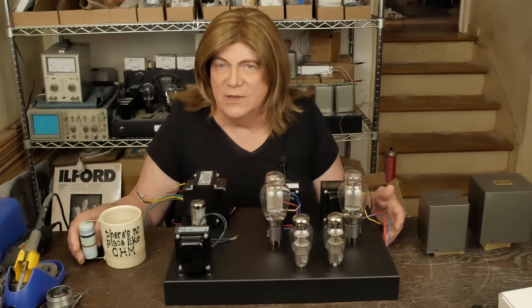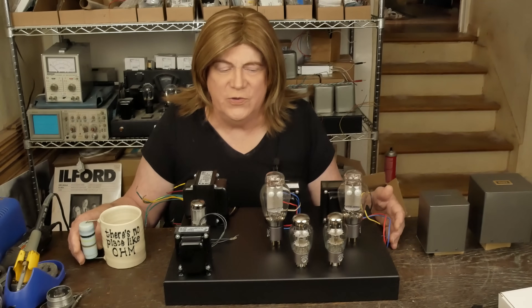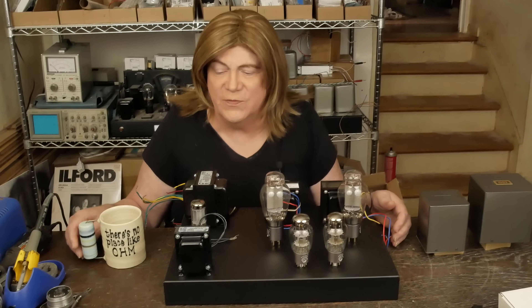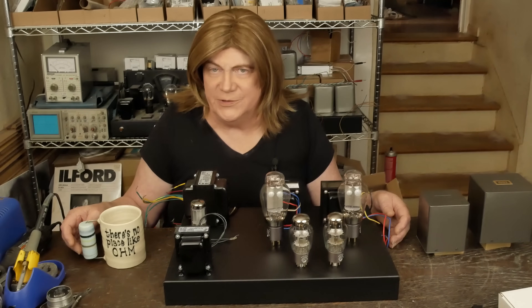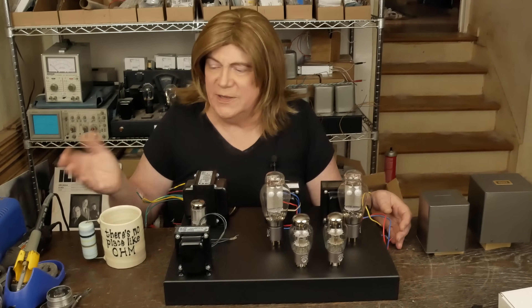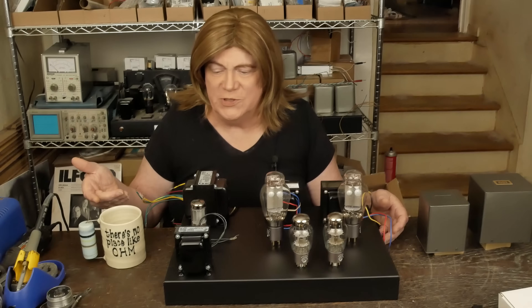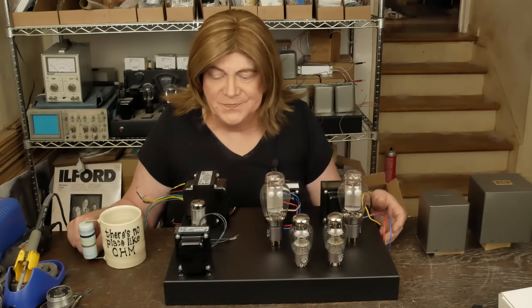I could probably get a discount coupon from George at Upscale Tubes USA for EML tubes when you buy an amp - he mentioned a 10% discount, though I have to finalize that with him. Could probably also work something out with Melody at PS Vane for a discount on Horizon tubes. I highly recommend getting a new old stock rectifier tube - I haven't found a new production 5AR4 that will reliably run on an amp pulling almost 200 milliamps. The NOS ones will definitely hang in there for the duration.